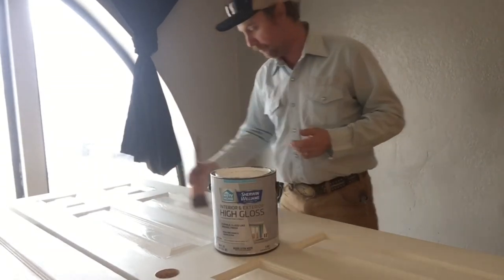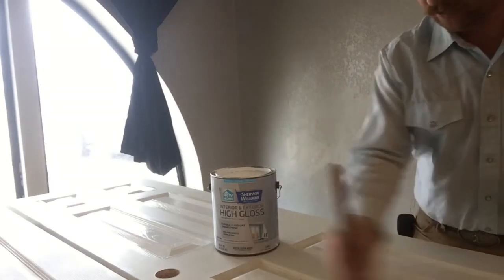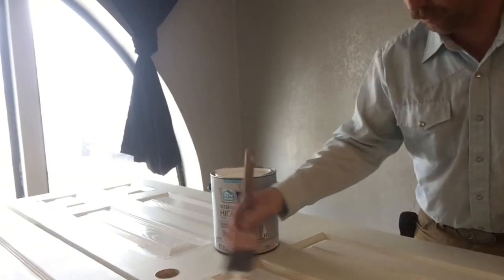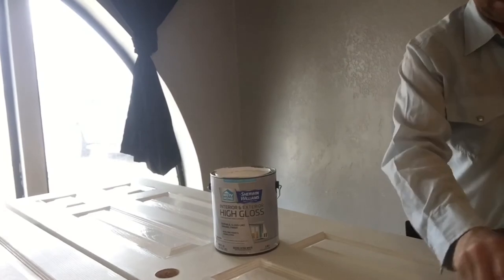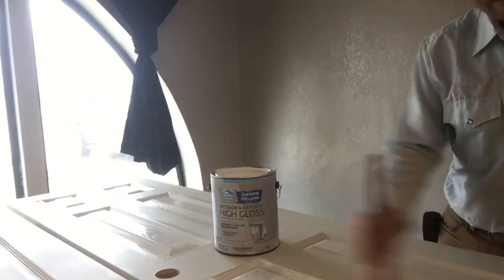Do all the panels, and if you do this with exactly the same strategy every time, then when you get to doing your second coat on your door and you're now painting the same color over it, you'll know exactly where you have and where you haven't painted, because you do it the same way every single door every time.